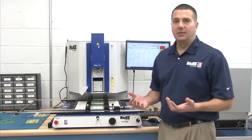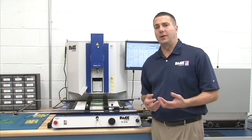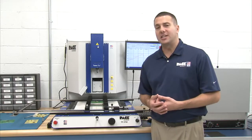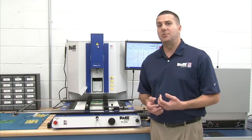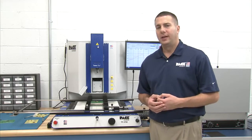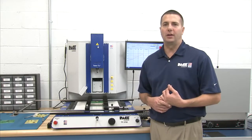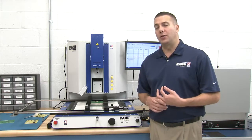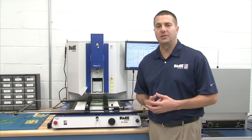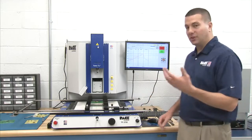Okay. So as you can see, using the TF2700, it's very simple, it's very user-friendly, it's very interactive. Profiling with the on-the-fly adjustments you can make allows you to be successful within the first or maybe second time you try to develop a profile. Again, the keys to that are, one, understanding your targets, what you want that profile to look like, and two, making sure you have good thermocouple placement and you understand what temperatures the solder is actually achieving.